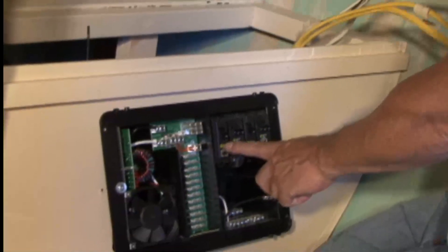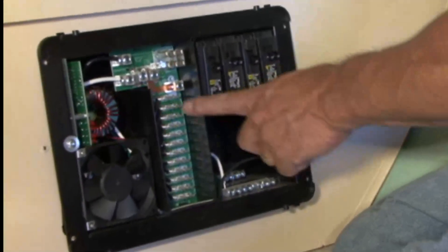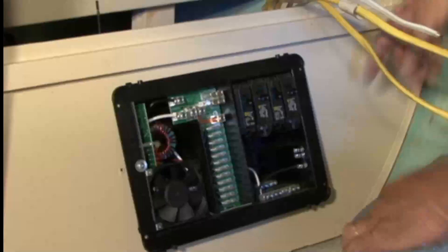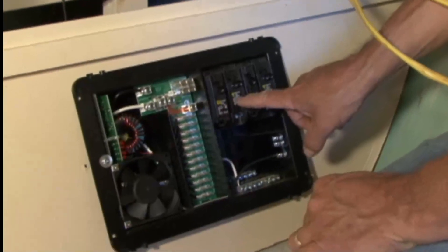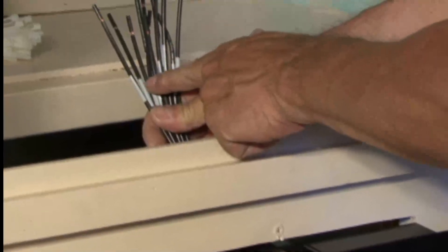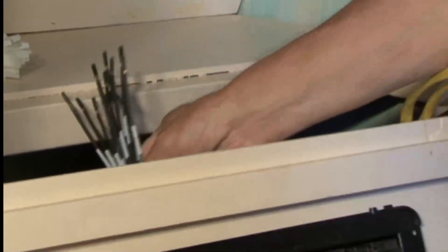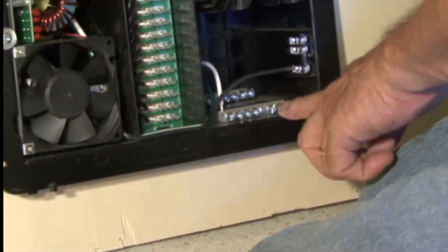You can see our circuit breakers for the 120-volt side of the power center, and then this is where our 12-volt fuses are going to be located. We're going to make our connections at each breaker — our main breaker and then our branch circuits. For the 12-volt side, the power center already has the wiring at the back so I can make connections using wire nuts, and then I just have to run my ground wire for the 12-volt items through and ground them on this bus bar.